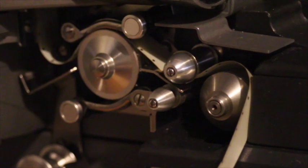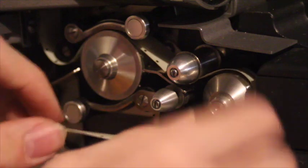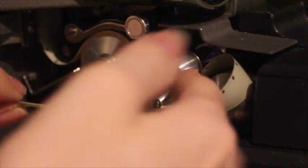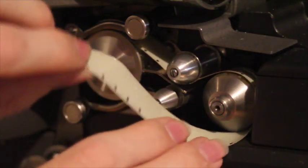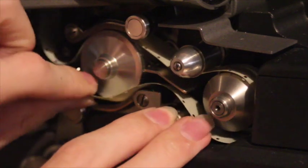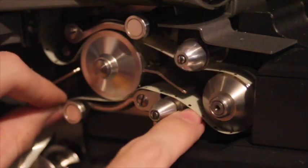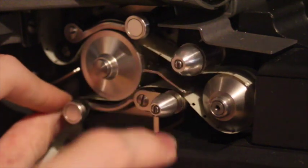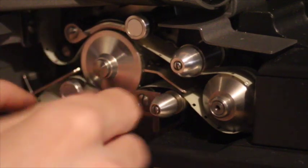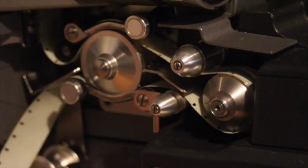We do a very similar procedure on the bottom, where we have the film going over the sprocket. These two arms on the sound drum will move up and down. Move them up, wrap the film around the sound drum, and make sure you've got a bit of tension in there so they don't close together completely. Pull it on so when you stick it under there there's actually a bit of tension. Put it underneath the sprocket and push that up so it locks, making sure this is taut around the sound drum — otherwise you'll get wobbly sound and it won't sound very nice.